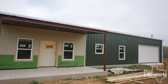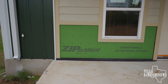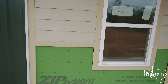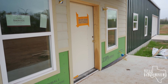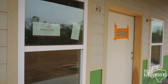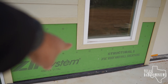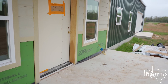As you can see, the metal mill work is done. We use the zip wall system on the outside. We do hardy board on this one — hardy board down to three feet, and then from there on down we're going to do stonework. The windows are Simonton windows — these are vinyl windows and they're white. We're going to do stonework from here on up, all around, under the window, up to the door, and continue the rest of the way. Every time we do stonework or siding, we do it under the porches.